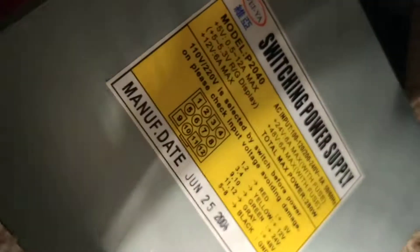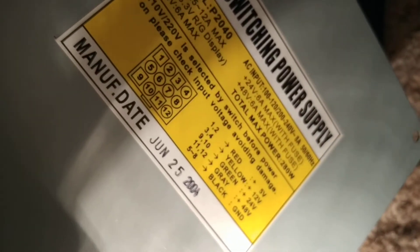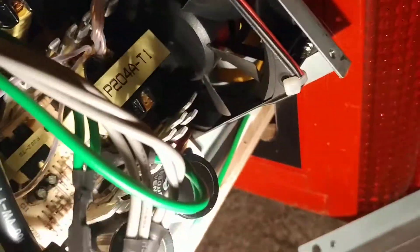I got these two greens, and on here it says the green is 24 volts. This 24 volt fuse right here has no wires on it, and there are two disconnected green ones. So I'd just put those green wires on this 24 volt fuse here, and put this gray wire back on.